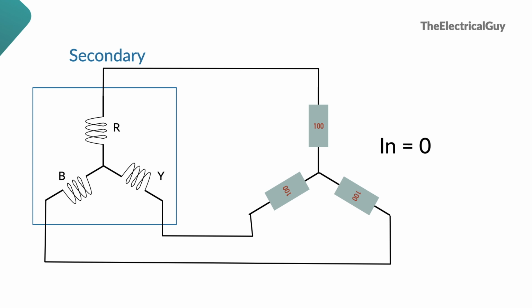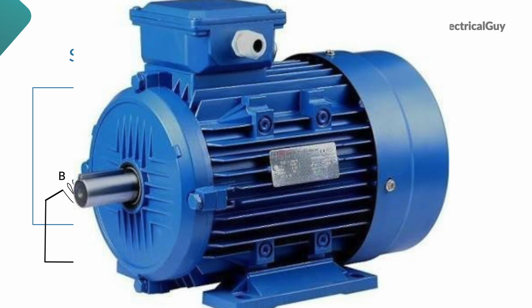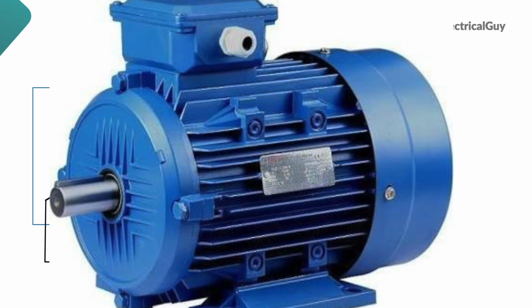So in an ideal situation or in the situation where load is equal, current flowing through neutral conductor is always 0. In practical life, this situation is not possible. You will not have identical loads on each phase. For three-phase loads like three-phase induction motors, you don't need neutral because that is balanced. You can put it in operation without any neutral wire.